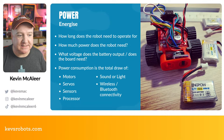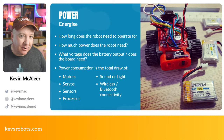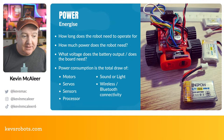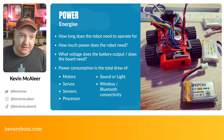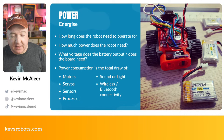What contributes to power draw? The motors — are they continuously on or intermittent? Servos need to be on constantly if holding a position, like a dog or cat robot holding its body shape, which takes a lot of power. Sensors require power too. The processor is probably going to draw more power than any other component besides the motors and battery. Different processor boards have different power profiles.